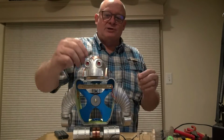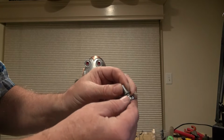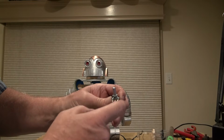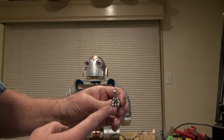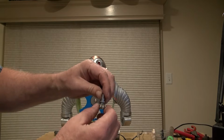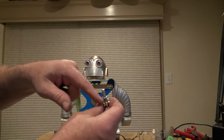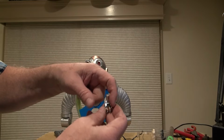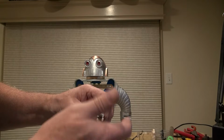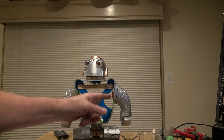is I've got a potentiometer here. It's a 3-terminal device, and what I'm going to do is apply the 9 volts to one pin, and the ground of the 9 volts to the other. And the center pin is going to be the tap that this potentiometer picks up on. So when I rotate the tap, it's going to be rotating all the way from ground all the way up to the maximum voltage that I have applied. And it's a 5K pot, so somewhere in the middle there is going to be the dimming range that I'm going to want.